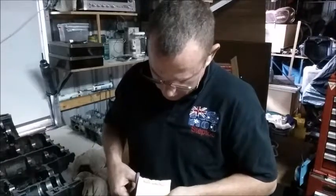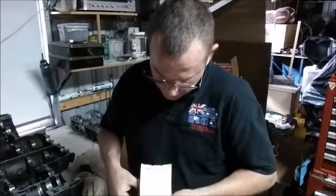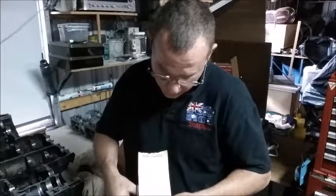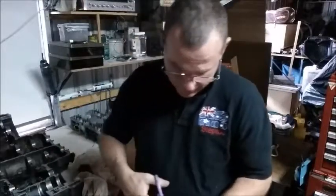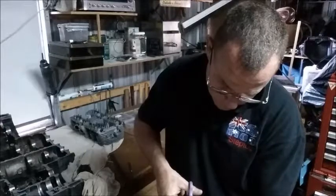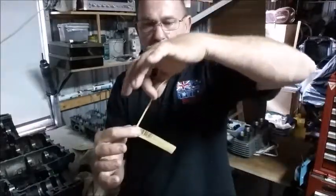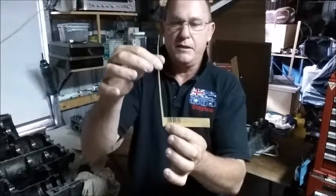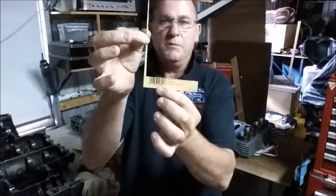This is a very fine angle. Last tiny little piece of a cut here. Without cutting through that other piece. And there you have 1.5 degrees. So we've got our base that we can put this on. We won't need all that length, so we'll be able to cut some of that off. But now we can set our base, and we set our die grinder up on our 1.5 degree angle.